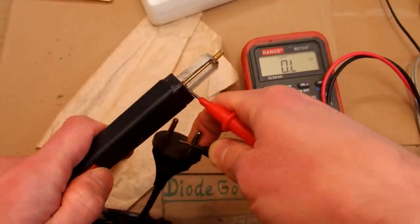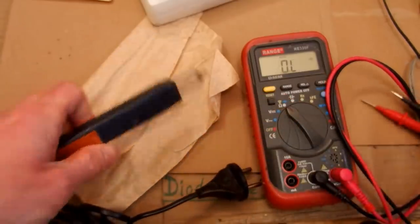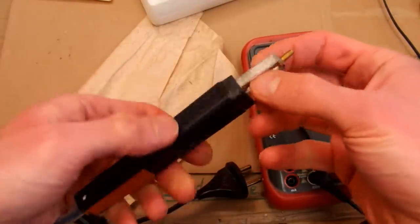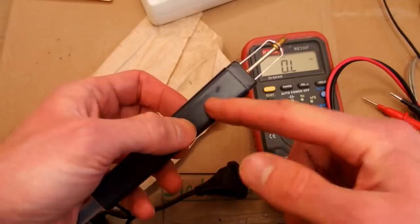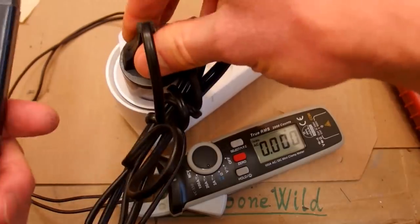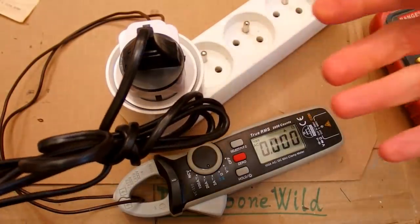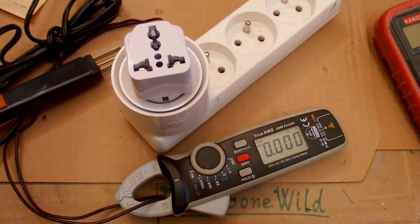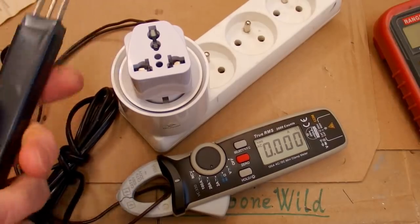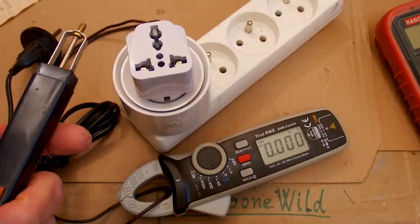The resistance of the coil is roughly 220 ohms, which is not so much — it would pass about one amp. But of course those contacts are not continuously on, and the coil has inductance as well as resistance. It draws about half an amp in operation, which is quite a lot. No wonder you can only run it for 5 seconds — there's probably no built-in overheat protection, it's just on you not to press it too long. But 5 seconds is probably enough to ignite a gas burner or oven.